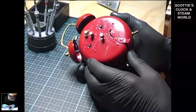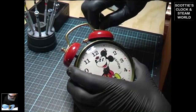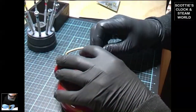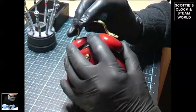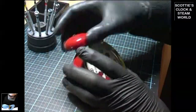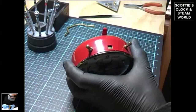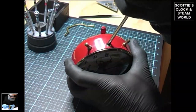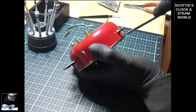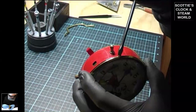On this model the pull knobs stay in place and they pull in through the back of the case. Now we'll remove the alarm, take the pieces out, put them all to one side. The cup bells will come out. We'll remove the face of the clock by very carefully inserting a screwdriver into the slot here and turning it to get a bit of a start on the case, then we can very carefully prise it open a little bit on each side.